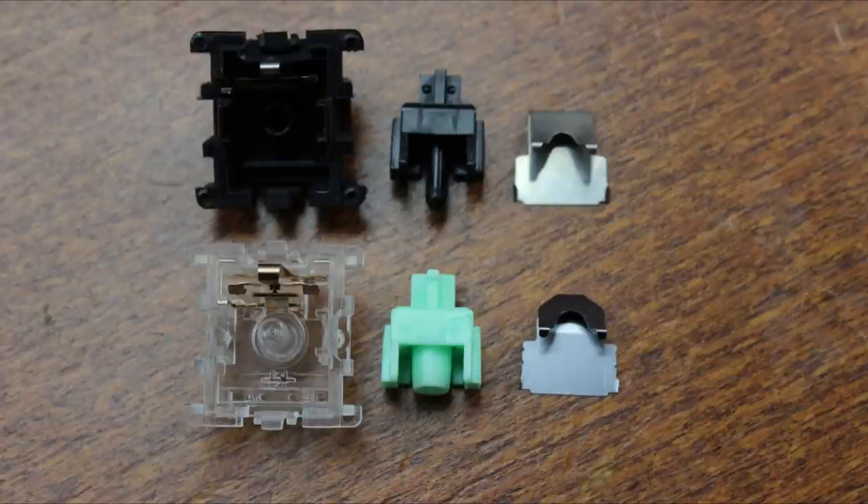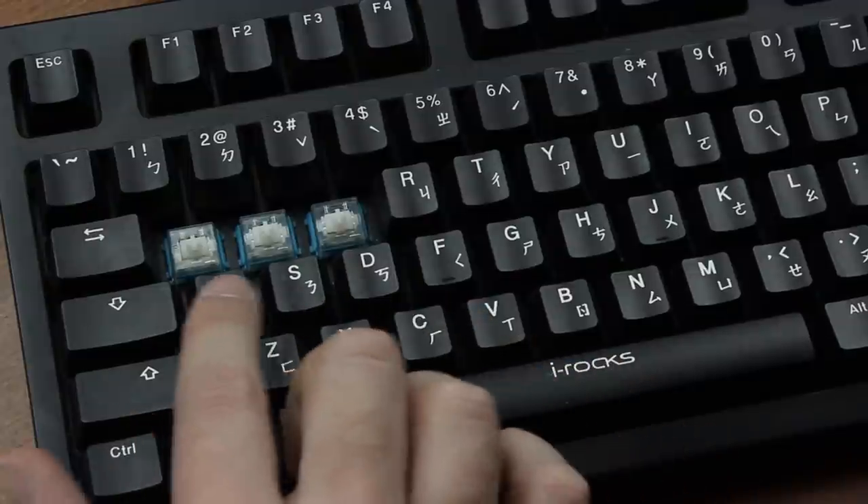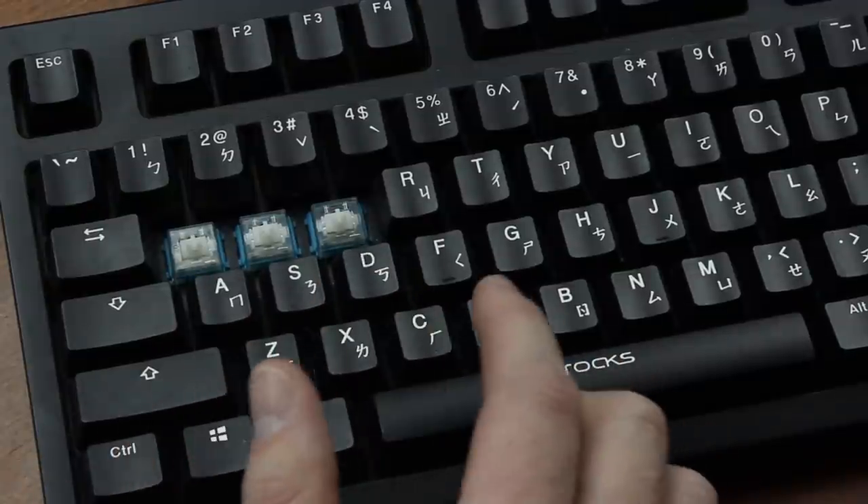These Pro World switches served as the base for the Clickies design, and are almost exactly the same except for the materials used to make the housing and the stem, which is Gateron's cap type where the hole and pole are reversed. There are also some small differences in the leaf spring itself — the teeth are at a slightly more acute angle and are bent backwards more, plus the corners are clipped. I'm not completely sure why. Also I wouldn't be surprised if the spring weight is different, but largely it's identical.